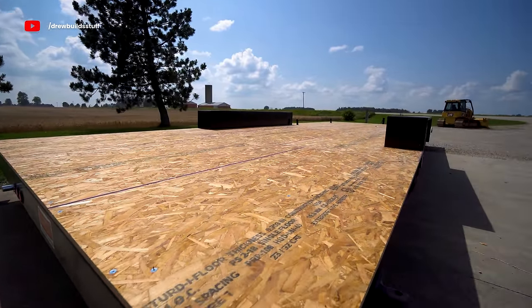And then I could really only measure the top section, so I have this laser level and I'm going to line it up with that top line. And then just make a couple ticks along this line and extend it down onto the lower portion of this wall.